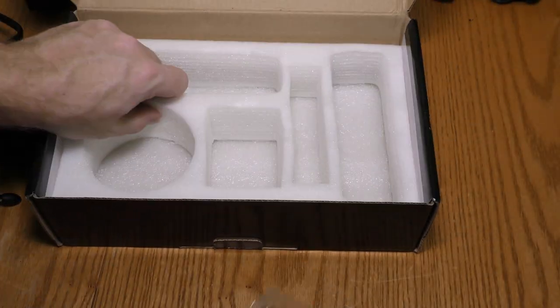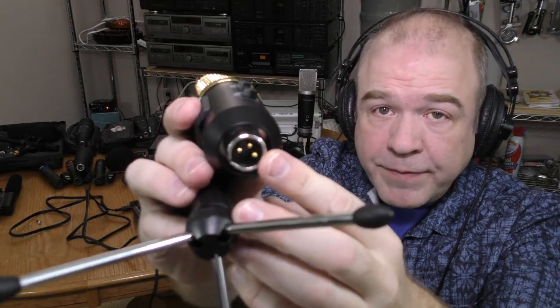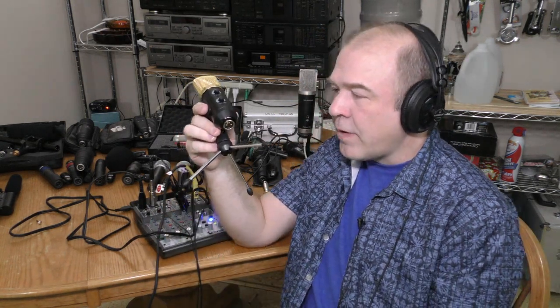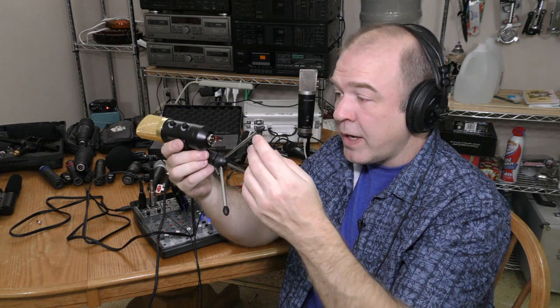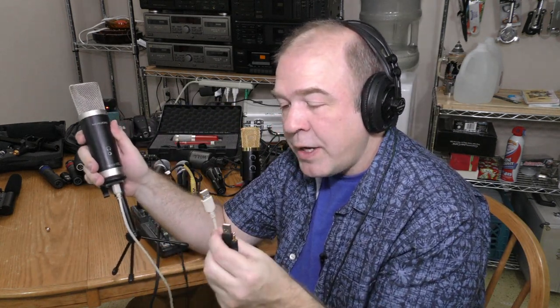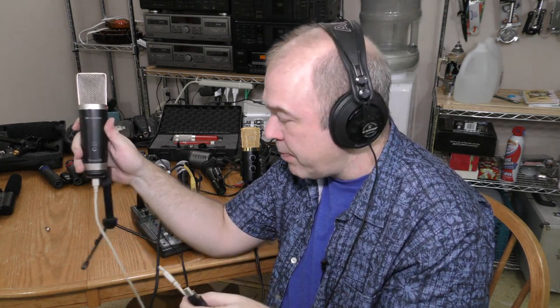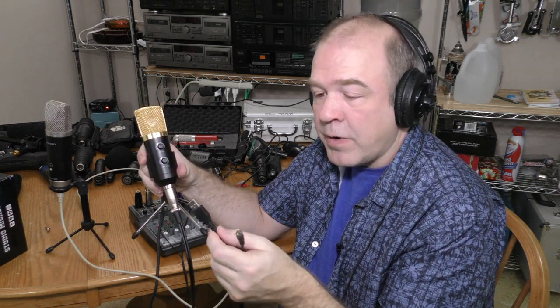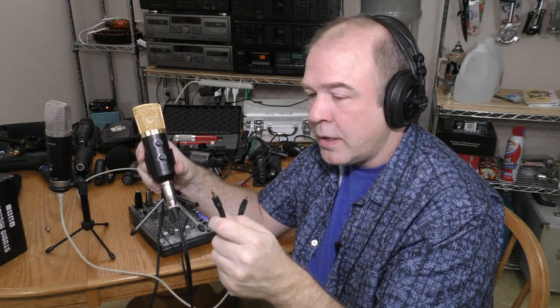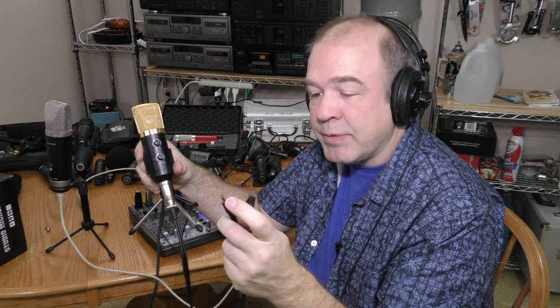There's nothing hiding under the foam. Despite the fact that it has an XLR connector, I'm concerned about running full phantom power into this, as it's designed to run off a USB cord with 5 volts, and phantom power is 48 volts. I'm worried I might blow up the electronics inside. My M-Audio Producer USB sends both audio and power through the USB plug; on this microphone the USB is used for power only, not audio.